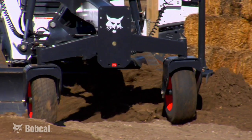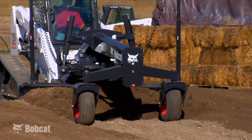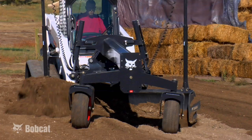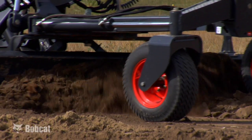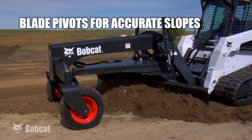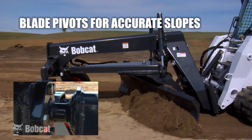On the front end of the grader is a bolster wheel that is able to oscillate to roll over uneven terrain, allowing the blade and the rest of the machine to stay more stable and giving you a finer grade. There are large flotation wheels on the front that also pivot — they are on casters. Since the moldboard needs to turn, there is a large ball joint and coupling on the front that allows the rest of the blade to pivot.